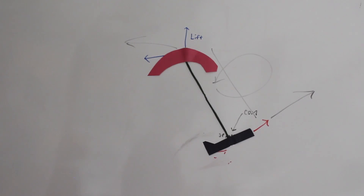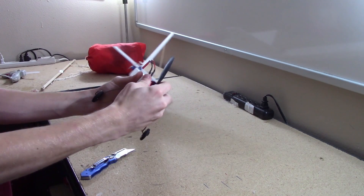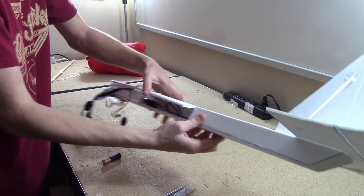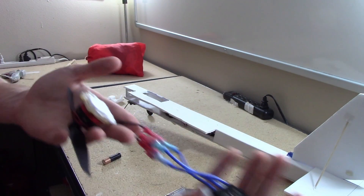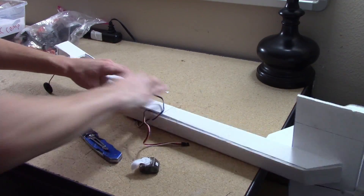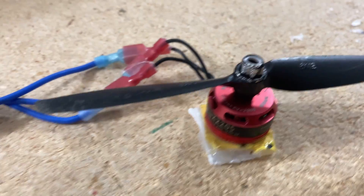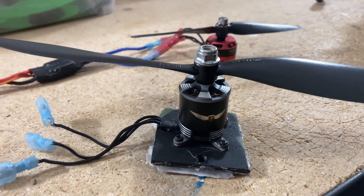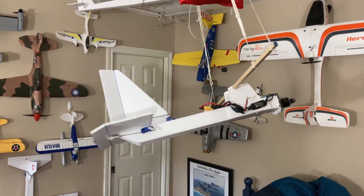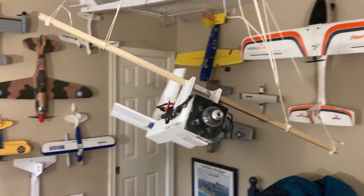So how do I go about fixing this? Well, you add more weight, but now because you've got more weight, you need more power — so why not add a heavier power plant? My solution was to take the airplane that I already built, cut the nose off, and stick a PowerPak C motor on it. This power plant is already about twice as heavy as the power plant that was already on the aircraft. So hopefully we're adding plenty of weight and we are definitely going to have plenty of thrust. As you can see, this basically just became a snub-nosed version of the paraplane.